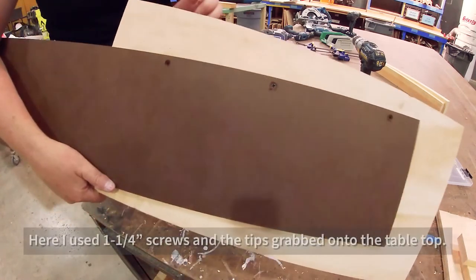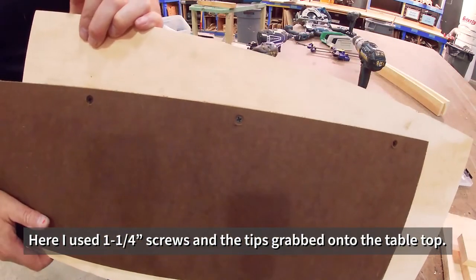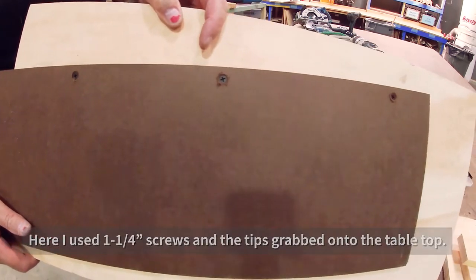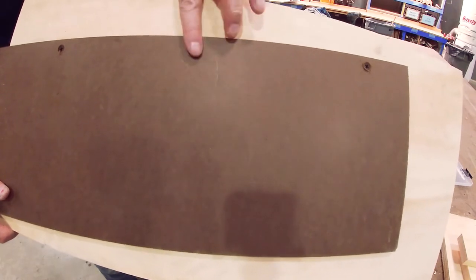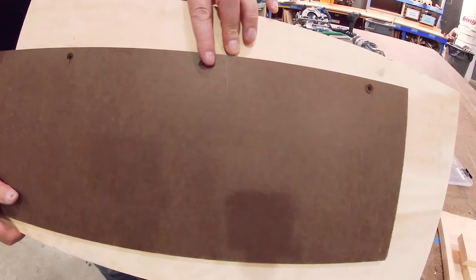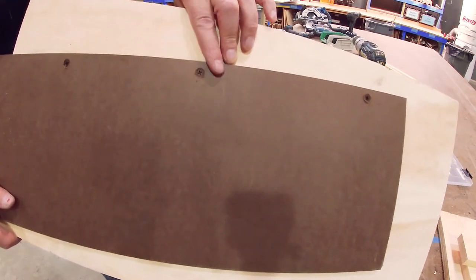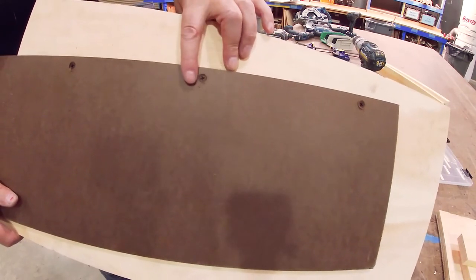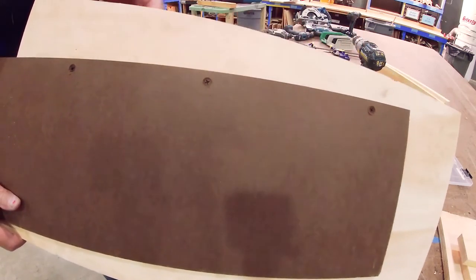We went through the wood, so you can see that. Nice and flush — you want that to be flush because you don't want shoes tripping on your decking of your stage. If you're doing stage combat or acrobatics or something more physical, you don't want your actors rolling around on the stage and getting torn up by drywall screw heads. So you need to get that screw below the surface of the masonite.